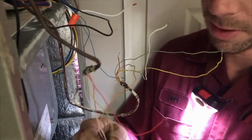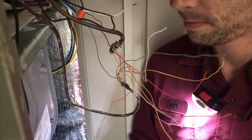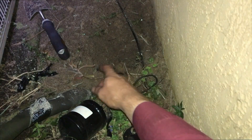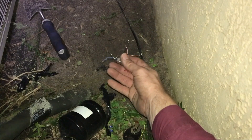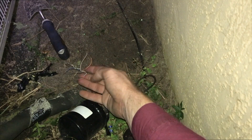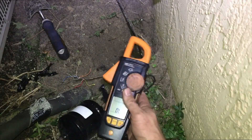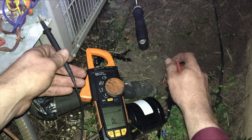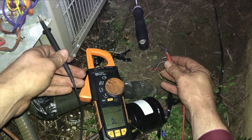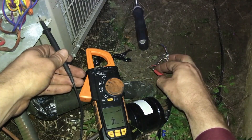Completely disconnected from our chase. I've dug out the chase. Let's see if we still got it happening inside our chase — definitely. We don't have anything hooked up to our condenser, just the chase wire, and it's the same on the inside unit — nothing hooked up except the chase wire. Done a visual inspection down as far as I can see into the chase, and the wires on the other side down into the platform. So now we're getting the short to ground on our orange wire. Turn on the meter to ohms with the beeper — there it is. Consistent ground on orange. My meter is picking up the same thing I already confirmed through isolation with the spark test.